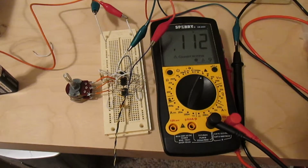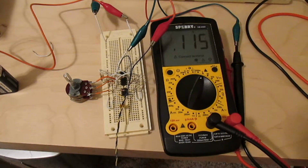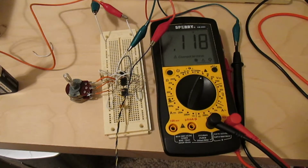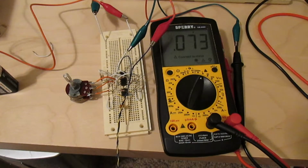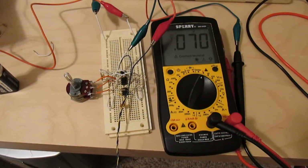I'm going to add some of this conductive jelly into it since I'm not using that right now. I'll see if this changes it much. Alright, now I've got the conductive jelly on, and that voltage dropped pretty significantly. Oh, nope. There, it's back up again. I guess it really just depends mostly on how much pressure I'm putting on these. It looks like 240 millivolts is the worst I've seen at the output, which is 80 millivolts at the input.